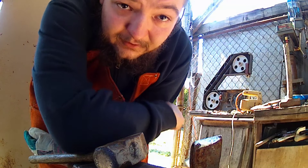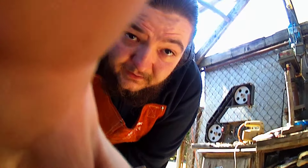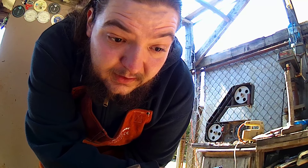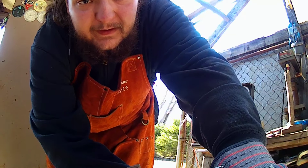All righty guys, so here's part of the trouble with using found steels like coil springs and stuff — they have a rough life before they get to you, and most of the time you get them because they failed, cracked, broke, something. As I was drawing out that taper, I found a fracture starting — a crack — so I'm just going to come behind where the crack is, cut that off, and then draw it a little farther taper. That happens sometimes with using this stuff, so be careful with it.